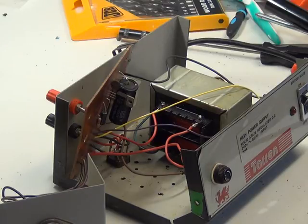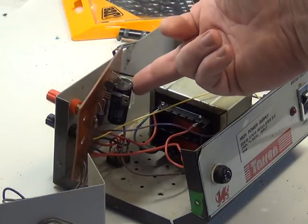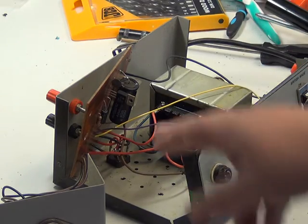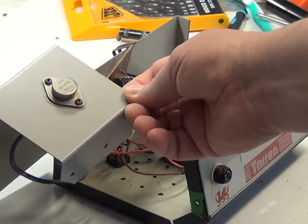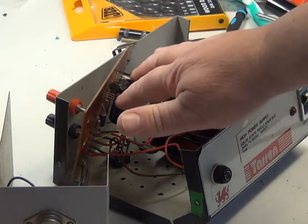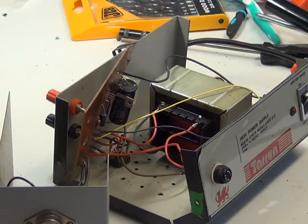It's 5 and a bit amps — 70 watts. So you've got the smoothing capacitor at 2,200. I presume that's some kind of regulator — it's not a number I recognise. And then the output is amplified by that pretty standard 2N3055 TO-3 case transistor. We're going to change those capacitors, because clearly the fact they've bodged that 4,700 in proves there's an issue there.